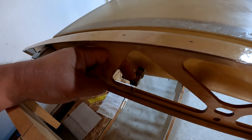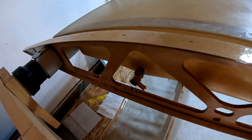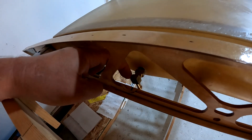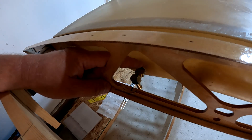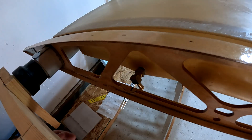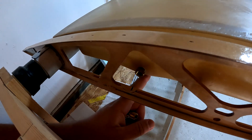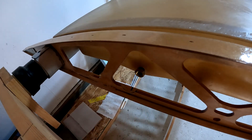Why am I eager to get rid of this solid 90-degree elbow? It actually has two reasons. One is that when this finger strainer is tightened all the way in and perfectly snug, it has to be pointed straight back or preferably slightly downhill. How would you get there? I would have to keep tapping this tapered hole that's in the fiberglass tank and hope that I get to that perfect orientation. So some kind of a swivel fitting here is hugely preferred. The other reason is pretty obvious - if I wanted to remove this barbed fitting, which we're supposed to do for an annual condition inspection, now the fabric on the bottom of the wing is in the way. I have seen some people put access covers - I'm trying to avoid that. So that leads me back to that banjo fitting.